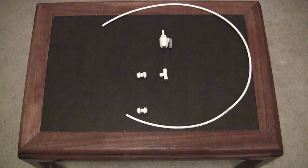These are some LiquiFit QuickFit connectors. They were the smallest I could find in terms of making a hole in the barrels. They require a 15/32nds inch hole and you can see they're kind of screwed apart. The barrels are quite thick — the lid is about 3/8ths of an inch thick — so when you're looking for a bulkhead connector, you need one that can accommodate that much width.